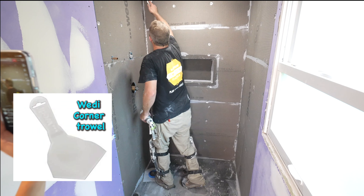What I'm going to use is a quarter-by-quarter trowel — that's what they want you to use for the sub liner. But first — you can see the floor pan fine? Okay. One of the most important parts of this is to use the 620 sealant. Any overlapping on the Wedi or the sub liner itself, you want to use the 620 sealant. This is very important for a curbless shower. We want to make sure that this extends over this shower pan by 4 inches — that's the requirement of Wedi.